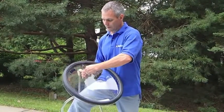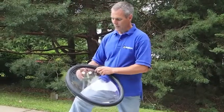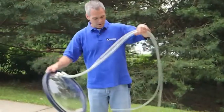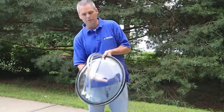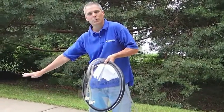What we're doing with the light cover is we are going to put it over the light, and then using these hoses that are attached to it, we're going to pump the water out from behind the light cover. So we're basically lowering the water level behind the light cover in relation to the water in the pool.